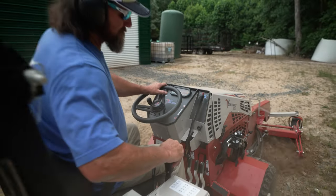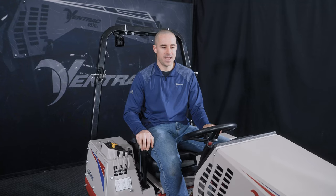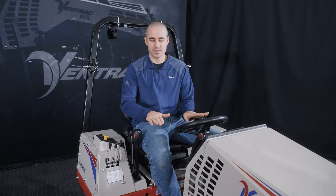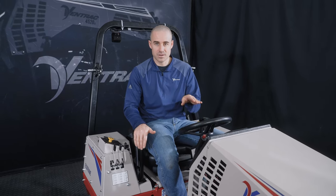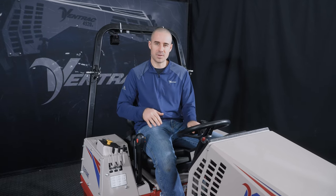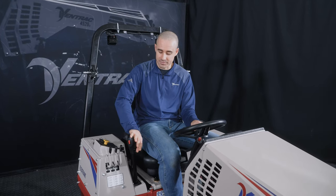If you don't do this and you run this not in float, let's say in a mower deck, and it sounds a little crazy, but I have seen this. Somebody's using a mower deck without this in float, then what's gonna happen is you could drive across a little raise in the ground and your tires of the tractor might raise up a little bit. Well, in this position, the hitch arms are locked rigid. So what it's gonna do is lift that deck off the ground slightly. So you might think you're mowing along pretty evenly, but then you'll step back and you'll get a glance of the whole property and you'll notice waves where it's like, why isn't that tracking? And that's because you're not in float.